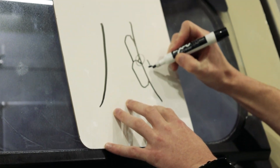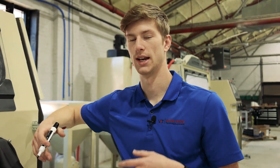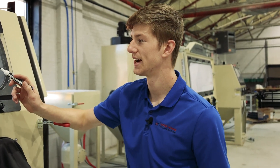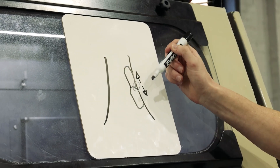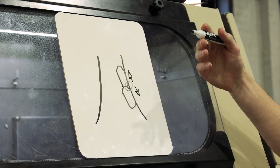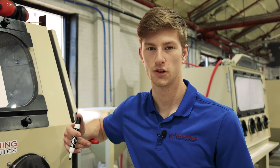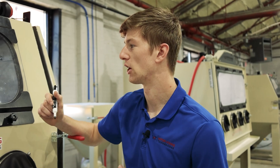When the connecting rod is being cast and it's hot, those voids are filled, but when it starts to cool and shrink, they start to separate. So you end up with tensile stress right there, trying to pull apart. The problem is when you actually start to use this part — like a connecting rod in a high-stress environment at high RPM — that's where it's going to start to crack. Shot peening goes in and breaks apart all those potential crack points, forming a more uniform surface through plastic deformation to relieve surface tension.